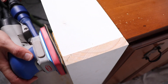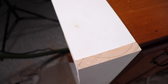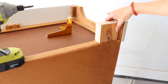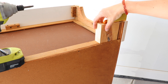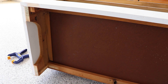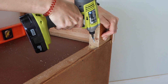Then I got my sander out and used an 80-grit sanding pad to make sure everything was nice and flush and level. I originally thought I'd let it sit on the ground, but I put it to my Instagram viewers and they wanted feet on it. I had to cut a different board to get the feet to screw in properly. I cut some blocks down to size, drilled a pilot hole into the wood, and screwed it into the base.